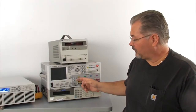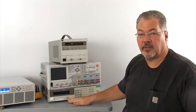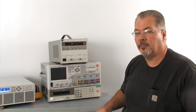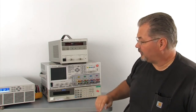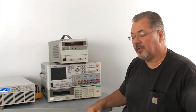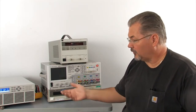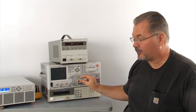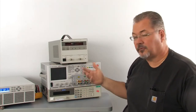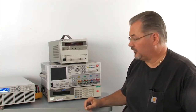So here are two additional power supplies that we also make that use different inrush limiting topologies. The first one that we just tested is a straight linear, which basically has input inductance in the transformer, which helps limit the peak inrush current. The next power supply shown has an NTC, which is a negative temperature coefficient resistor on the AC input line. And what that does is when the resistor is cold, it has a high resistance value, so that when you first turn on the power supply and the input caps are discharged, it limits the inrush current to a reasonable value. Once that resistor heats up in use, that resistance drops to a very low value and it doesn't dissipate a lot of extra energy in the box.